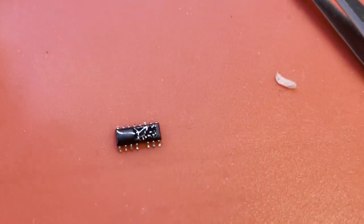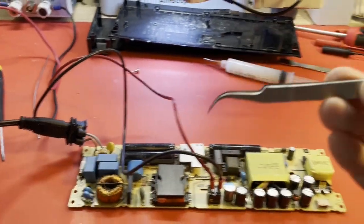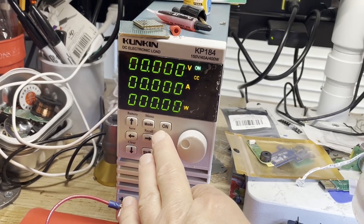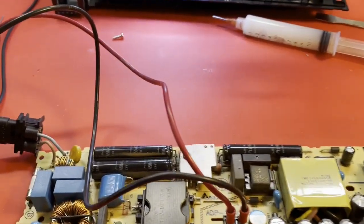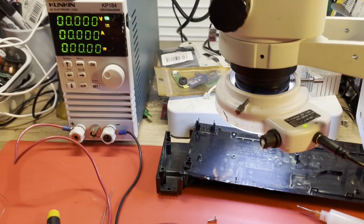Our DDA001 has been changed out. Now we're ready to see if we've done any good here. I've got it hooked to the load, set on six amps, and it is on. Let's get some AC voltage in here. Let's see if we get anything when I jumper this. Nope. I think I heard it kind of grunt, but no — not going to be that easy today. Trying it again, but I don't think it even bumps.